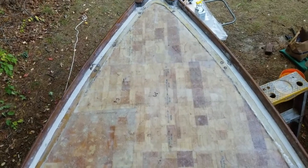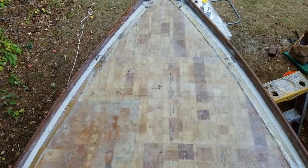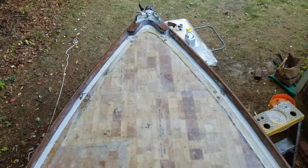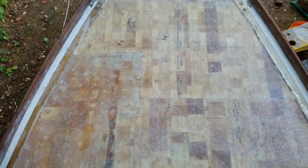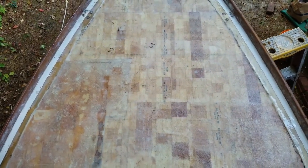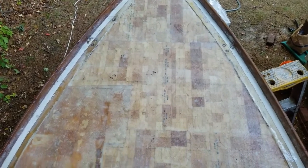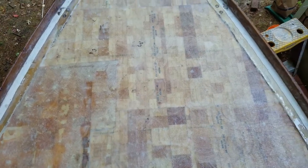We would saturate the balsa, put that down on top, and then go right back over the top of it with even more epoxy resin. And it just absorbed it. Then we got done with that up there, and we said, man, that was a lot. And then we came back here, and each of these pieces is huge. I don't know if you can see number two right there. By the time we got doing number two, anyway, my point is, it all got done. This is all done. It came out really, really good. And like I said in one of the early parts of the video, there are no voids in it. There are white spots where I hit it with some thickened epoxy last night. There are a number of places like that that I wanted to get filled in, some gaps and stuff like that.